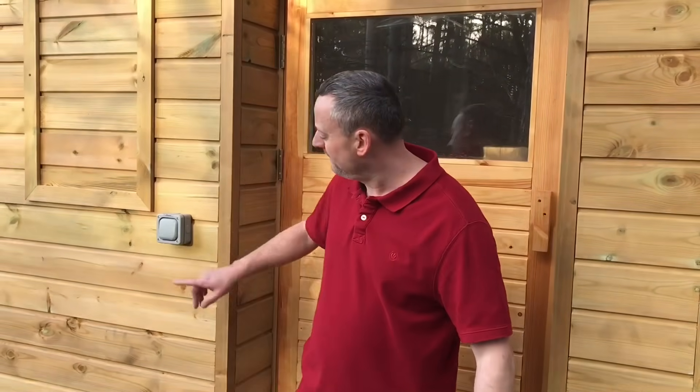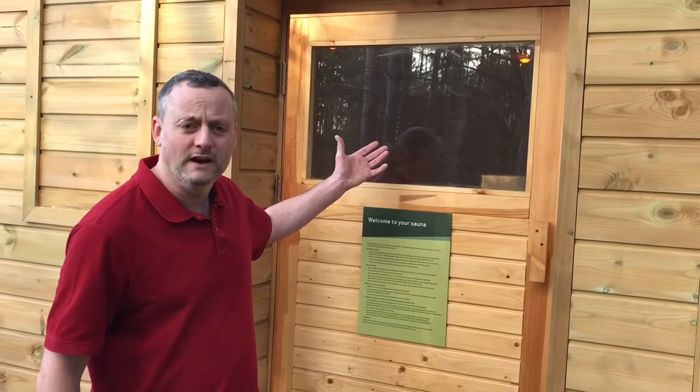The control gear to turn on the sauna is actually in the main building itself. If this was a swimming pool complex it's likely to be on the outside of the building or in an adjacent room. It's a special location because of high humidity, lack of clothing, and moisture in the environment, making it more susceptible to the effects of electric shock. We do have a switch on the outside however to turn on the lights, which is IP66, so when we turn this on we've got the lighting system in the sauna on.